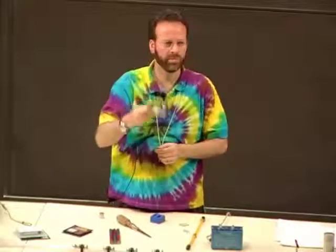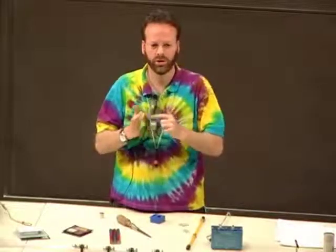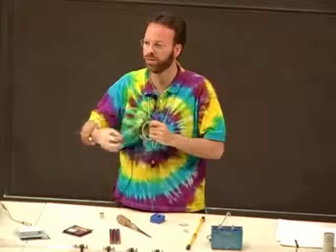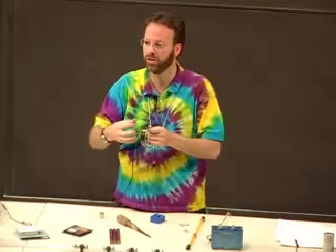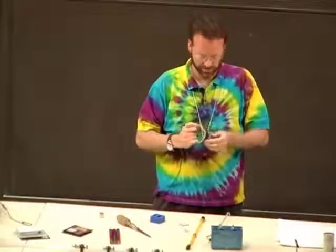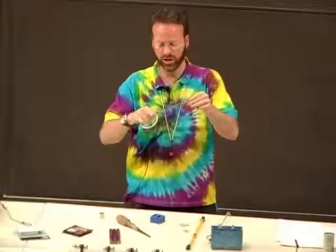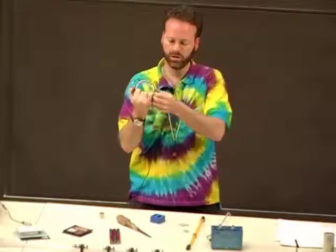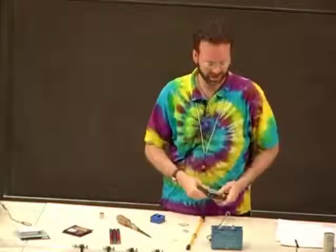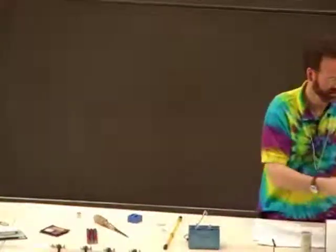So sometimes you need applications where you don't want any static charge. They do sell ones with a conductive grid inside. And if it's a conductor, then charge won't accumulate. It can spread out or flow off away. But if it's an insulator, it wants to stay put. So they made it out of cellulose, and that tends to reduce it significantly. Thanks for sharing that. I learned myself.